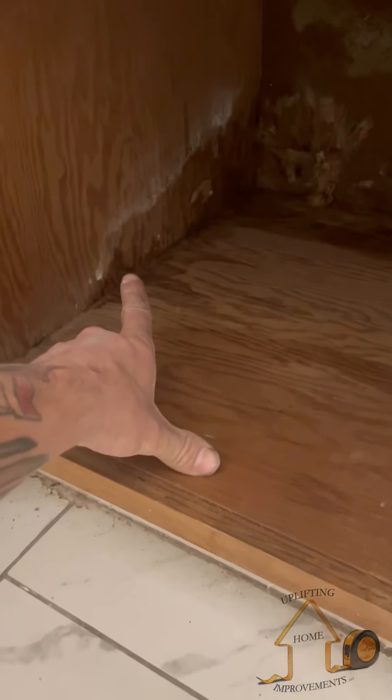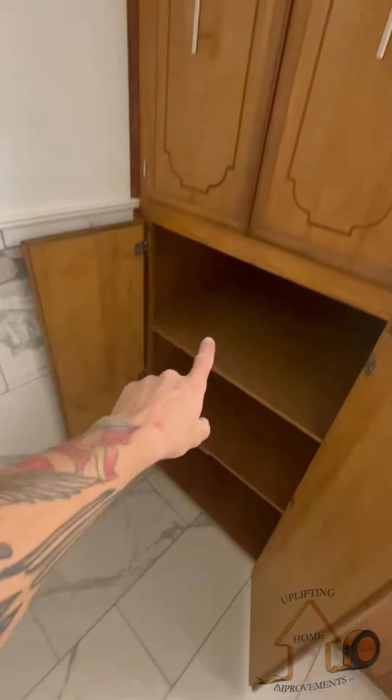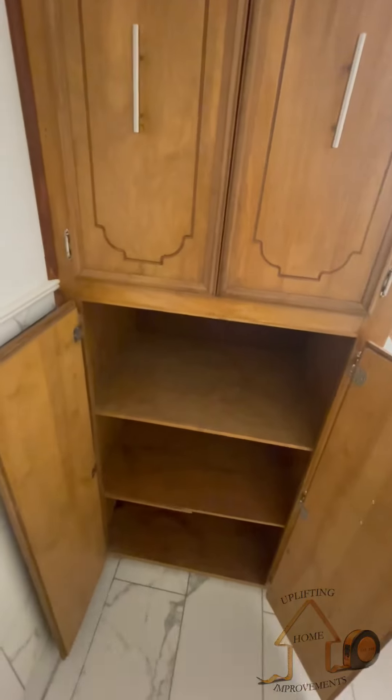Here's the other side of the wall — water damage. This is wood and it soaked up a good amount over two years. I believe that's MDF back there, and drywall, and it just soaked it all up. So we're gonna have to address this from the inside of the cabinet. Rather than tearing out the whole cabinet, we'll cut out two feet of damaged material and replace it. This shelf is already gone from the damage.